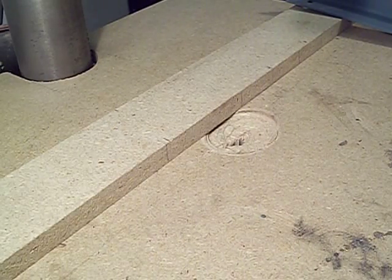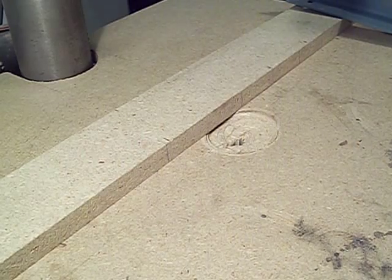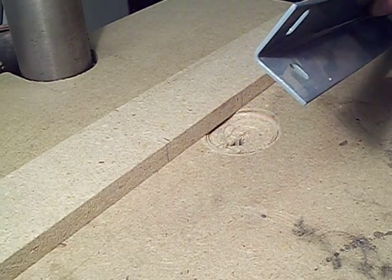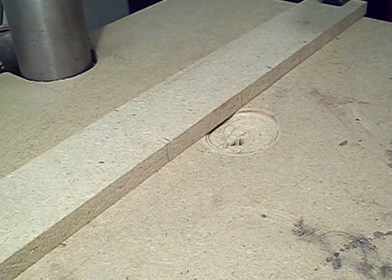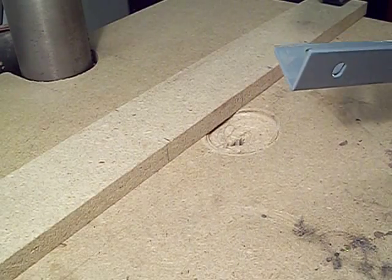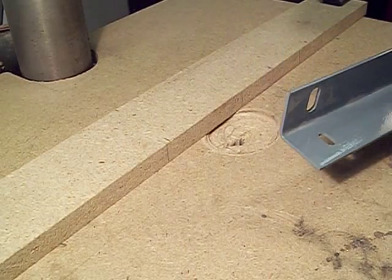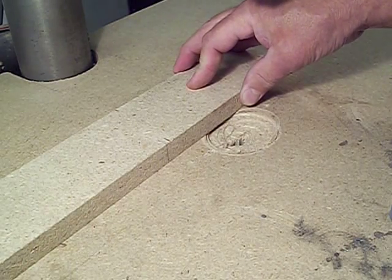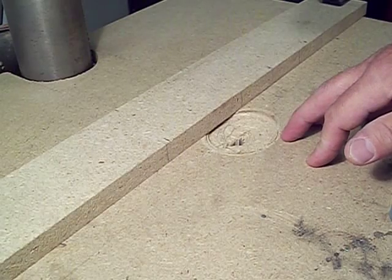What I wanted to do was demonstrate the effectiveness of the sharpening jig with a piece of steel here. It's an eighth inch angle. I've got the drill press RPMs turned down to 430. Usually whenever you're drilling steel, you want to use a slow speed, and the thicker the steel, even a slower speed. With this case, eighth inch steel, 430 is good. And you always want to have some kind of a fence or at least a clamp situation where you're clamping the metal down.